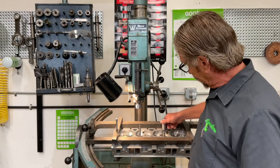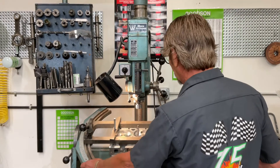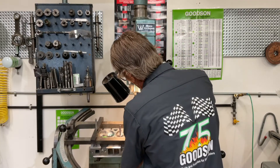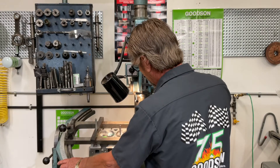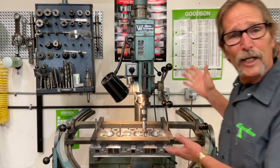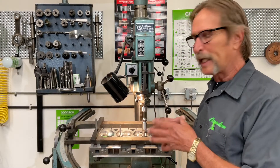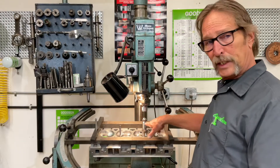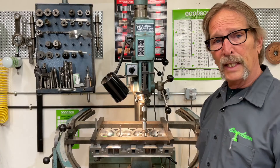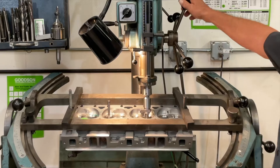I've already changed out the cutter tip — this is the new Saber-Tooth cutter. I've moved over to the other intake valve seat. I do have to reposition my cradle and get my head back over here. I put a little pressure on that, let off on my air float, and come back to make sure I have an uninterrupted, non-binding situation. Yes, this is a ball head — it can be considered a U-joint — but we want to be as perfectly lined up as possible so the drill head isn't influencing the ball head, which would then influence the valve seat cutter blade. Everything needs to be leveled and lined up as absolutely true as possible. Let's go ahead and cut this valve seat now at 115 RPMs.